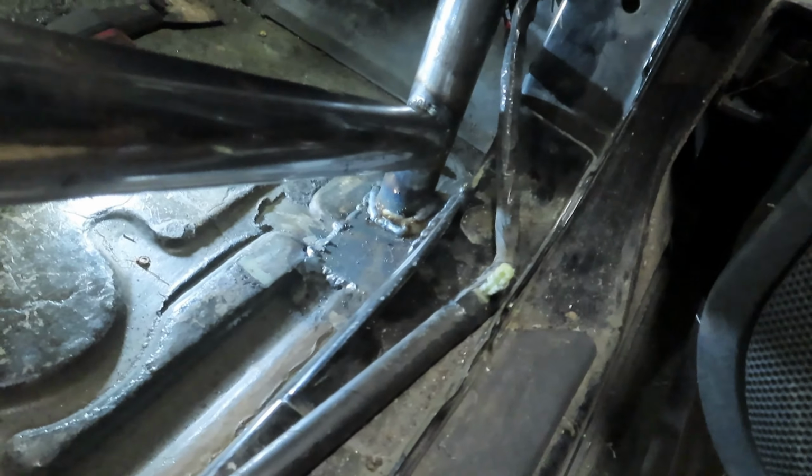But I was like, well, wait a minute, can I still at least MIG weld the down bars to the plates that go on the floor of the car? Now, don't judge that, but see how we MIG welded this to there. I asked a fella that used to build cages for a living, and he's like, yeah, I don't see a problem with that. So we did it all, and I was emailing pictures to an NHRA cert guy because I had some questions about some gusseting for the lower door bars where I couldn't fully weld it.